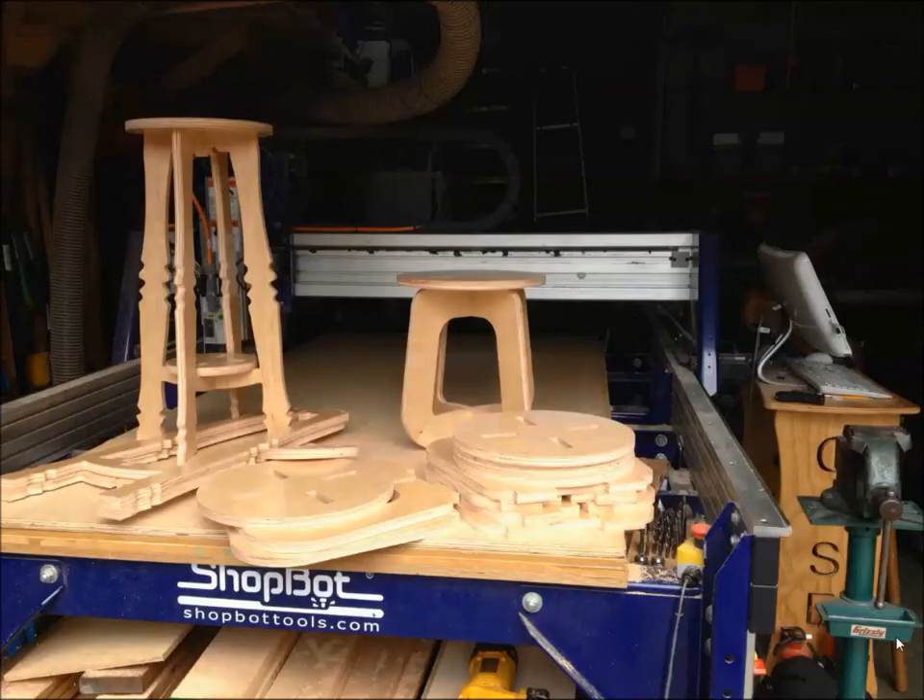To wrap up: the machine will cut it — if you set the slot to 0.69, it'll cut it to 0.69 with such tight tolerance that parts won't slide together. So always add a tolerance and make it easy on yourself when modifying for different material thicknesses. If you come up with something better than what we did here, feel free to share it on the forum. Hope what you saw today helps you make multiple parts out of different thickness materials with this nice slot-together style project. Thank you very much and we'll see you next time.